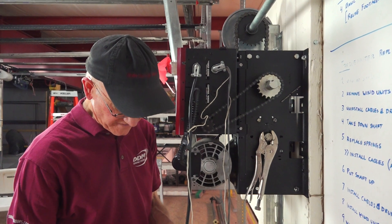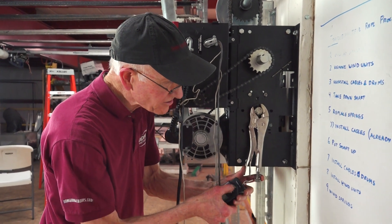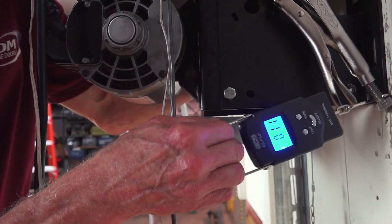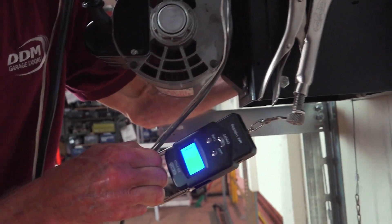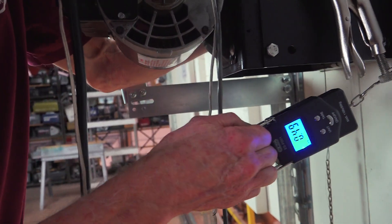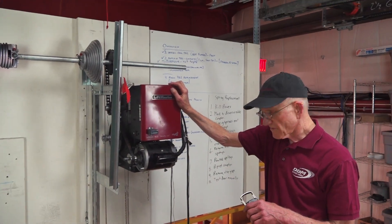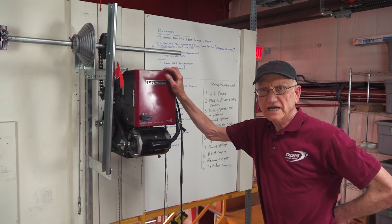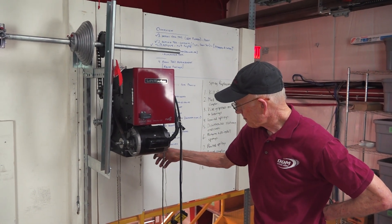I think you can get these on Amazon for about 10 bucks. You put the scale down below and turn it on. You can see that it's breaking at about 7 pounds. So with the vice grip, we were pulling about 7 pounds before the clutch would slip.